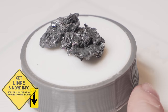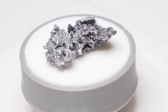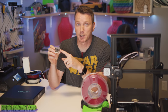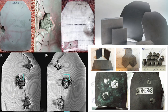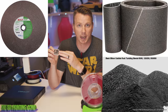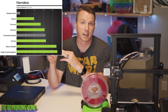So this is a product — it's a mineral called silicon carbide, or carborundum. This has been around since the 1890s. It's both naturally occurring and can be manufactured, which is the more common of the two. The naturally occurring cases are actually typically from meteors or meteorites — so this is like space-age stuff. It's most commonly found in bulletproof vest plates, certain high-end brake pads, and various abrasives and grinding tools. It's very hard — it can cut most crystals and glass, though it can't scratch diamond. It's a nine on the hardness rating.